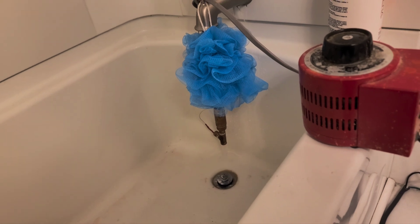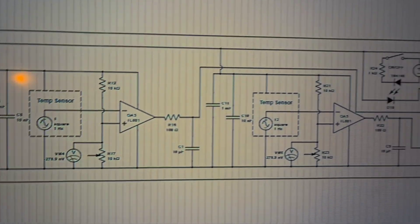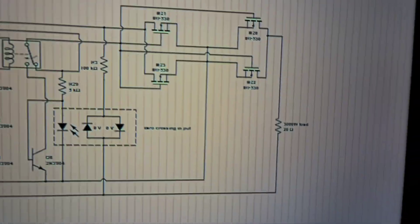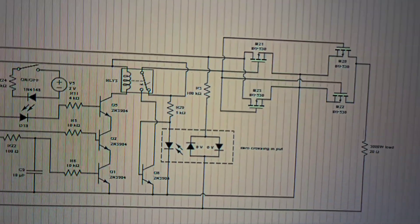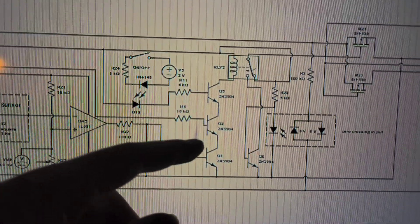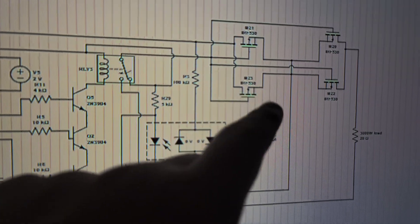I have a circuit I designed with a few temperature fail-safes and an AND gate to protect this system. I wanted to use MOSFETs back-to-back with an isolated gate driver to flip them on and off — not a relay — and I want an AND gate that takes three inputs, and if all three are working, we're allowed to drive the MOSFETs on and off.